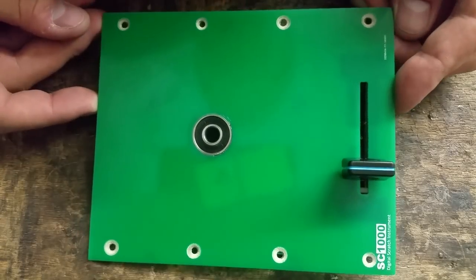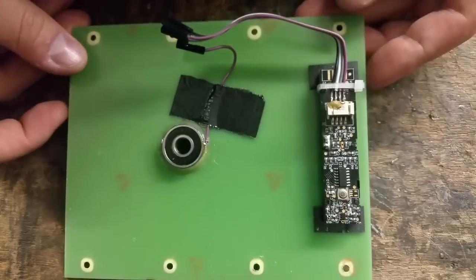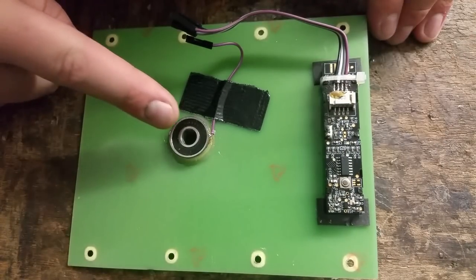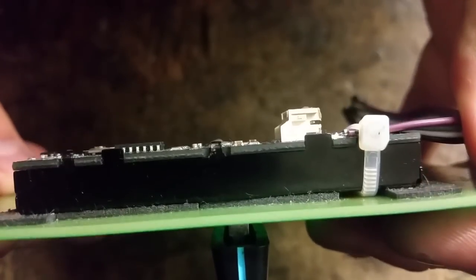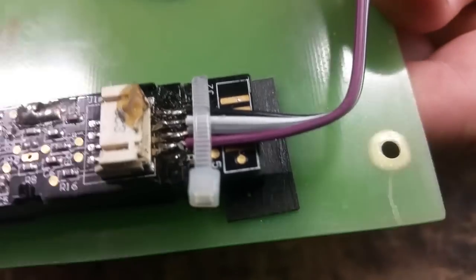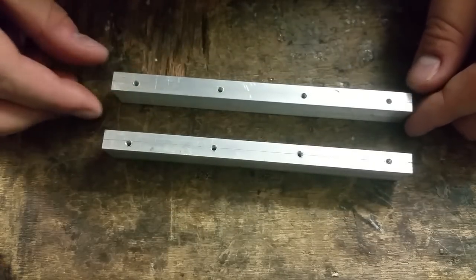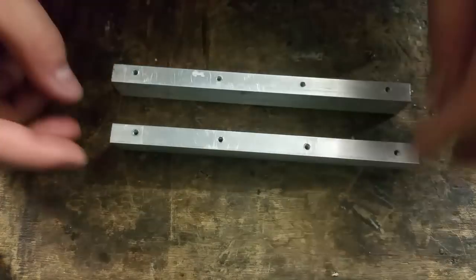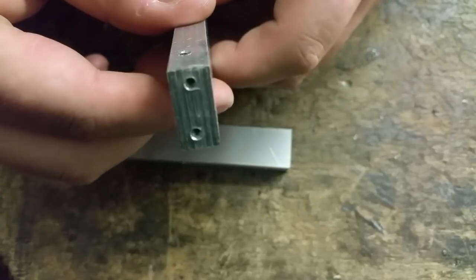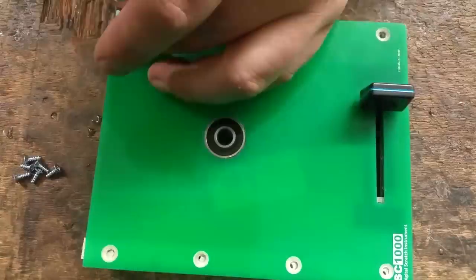Now onto the enclosure, which is made from PCBs. This is the top of the enclosure, where the jog wheel sits. I've already assembled this one, but basically you just have to glue a bearing into the hole and solder a wire to it, then attach the InnoFader using double-sided foam tape. Normally you'd want to use the 4-pin large cable that comes with the InnoFader, but I just soldered DuPont-style wires directly to it. The sides of the enclosure are made from two 20x10mm aluminium bars, which have been drilled with a 2.5mm bit and then tapped with an M3 thread. You can use the top and rear plates as a template while drilling if you want. Just screw the top and rear plates on and you're good.